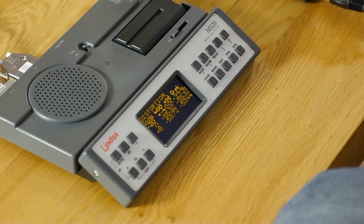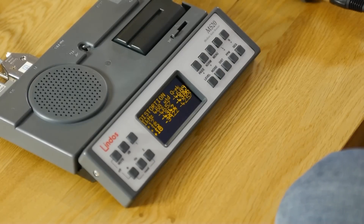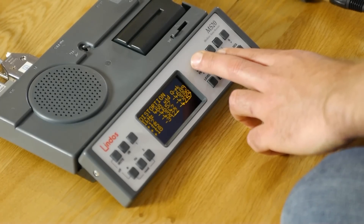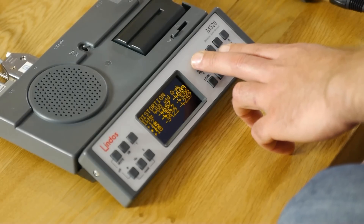The distortion results: the 1kHz at 0dB is about 5dB above the noise level, and then the higher level distortion results are creeping up. It's okay — they're below audible levels, but they're not what you'd expect from a top system.